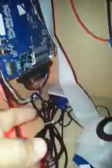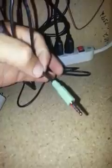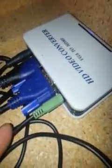It won't go anywhere. And as for your headphone jacks, this is your headphone jack here, your headphone jack wire out of the 16-in-1 game board. It's coming down, and I left it a little spooled up here so you can see it. You're gonna be taking this guy and this guy here. It's plugged into your HDMI thing. You could unplug it from here and plug both this wire and this wire into your adapter, and then plug that into your surround sound.